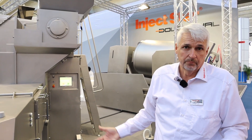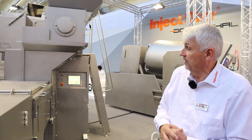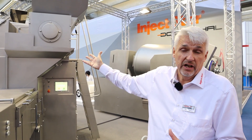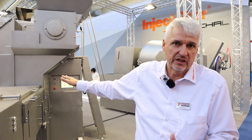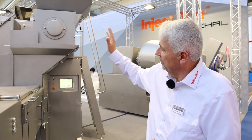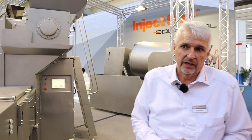If bones enter at zero degrees Celsius, the product exits at two degrees Celsius — within safe temperature control. The low calcium output is critical for human food product standards. This machine works on all kinds of red meat bones — pork, beef, lamb, deer, whatever you want. It's not designed for poultry, which has different systems. It can also do meat harvesting from raw pork heads, and it's the only machine worldwide that can do this.